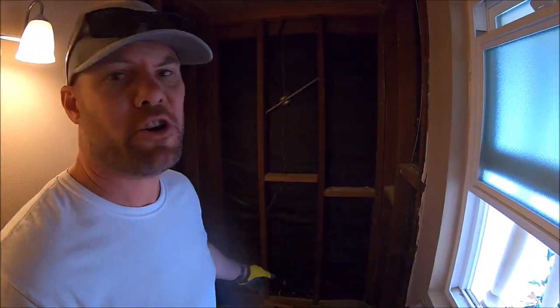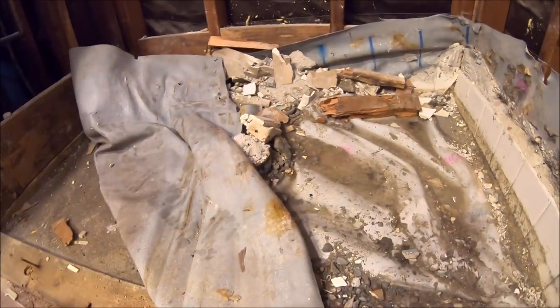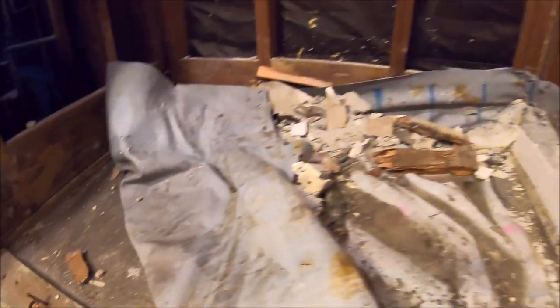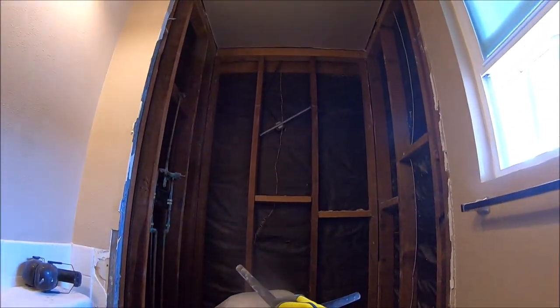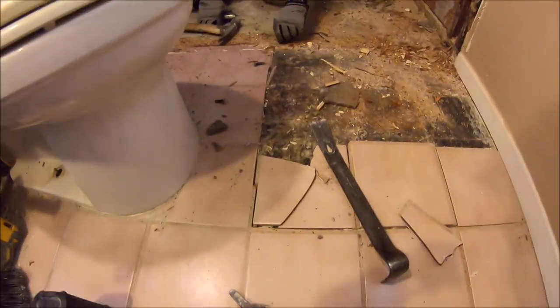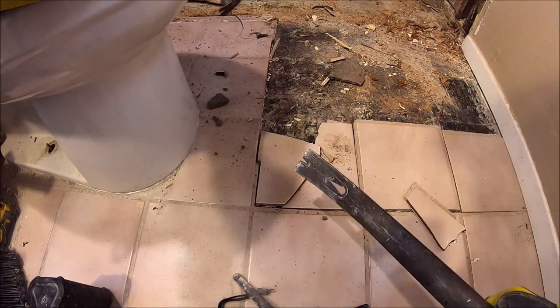Our strength training workout is almost done. Let's show you what we have underneath this shower pan. We have a pan liner here — we had a two-inch float on top of this pan liner. We do have some water pooling up there, and we have a pre-slope underneath this pan. We'll need to remove this pre-slope, remove the lag bolts out of this curb, prep all our studs, cut this valve, install a new valve, raise the shower head, and get going with our backer board, shower pan, curb, and waterproofing. Demo is going smooth — shower is removed, floated walls and pan removed. The floor is coming out very quickly and easily. I like to demo bad installs.